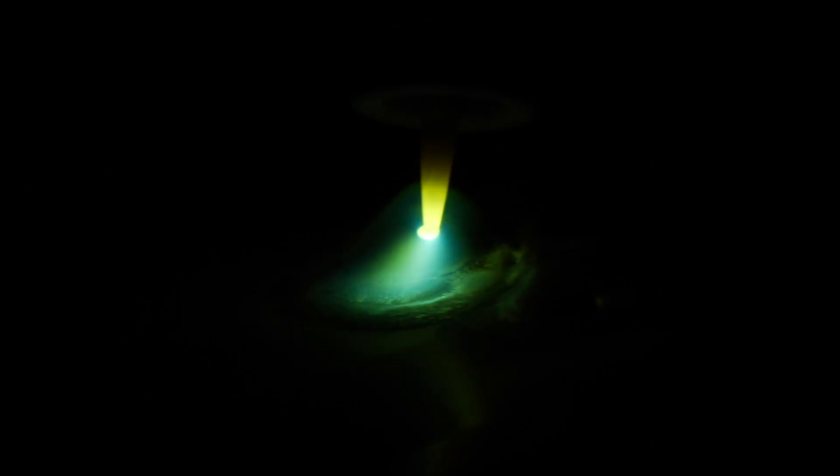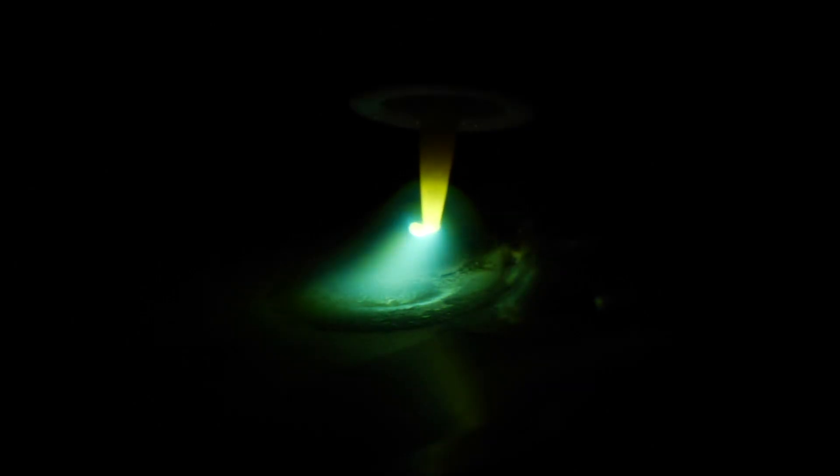If you do not have a balance setting that's correctly set up, the tip of your tungsten is going to become misshapen, flutter, and get wrecked really quickly. Welding with a ball preparation on the end of your tungsten will withstand any inaccuracy much better — so you can get welding a lot faster and your tungsten will not misshape or distort.